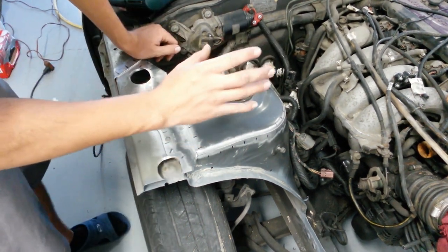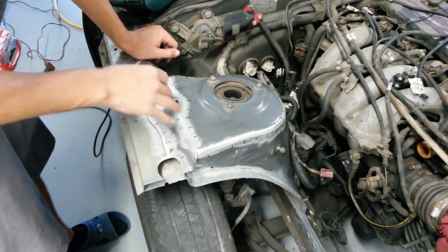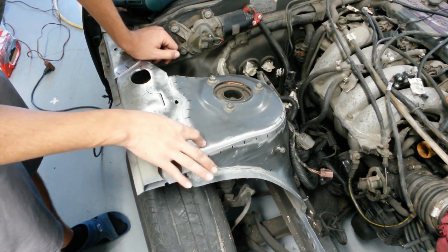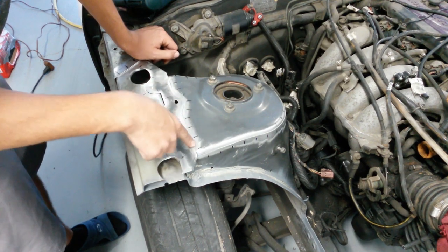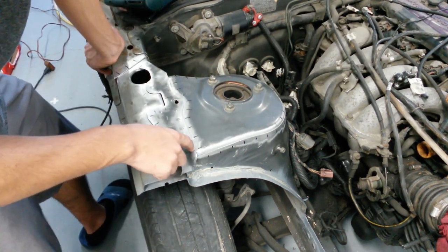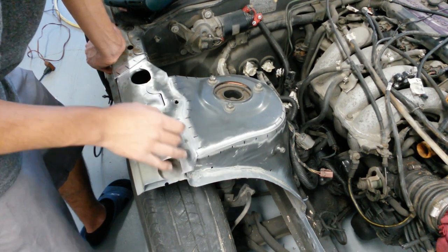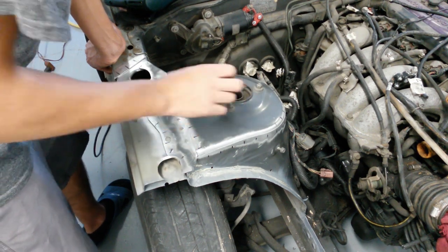Second reason is because of heat and distortion. Now if you guys know welding sheet metal, oftentimes if you heat up an area too much, you can deform the sheet metal. Or even worse, you can blow a hole through the metal. So when you're welding these 1 inch continuous beads, I think there is a higher chance of you blowing through the sheet metal, and on top of that also distorting the base sheet metal.